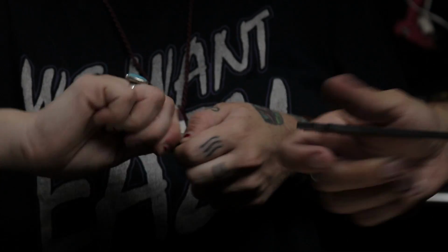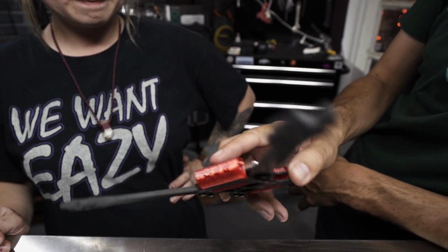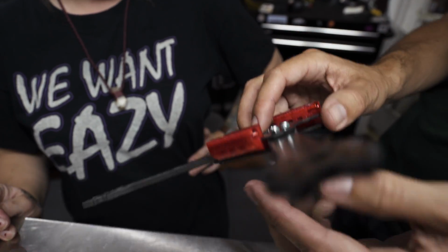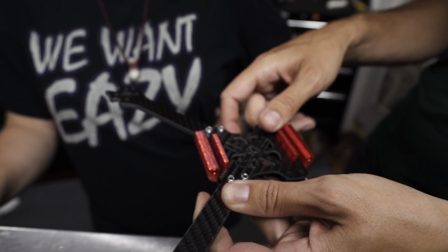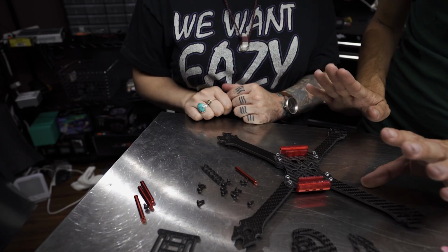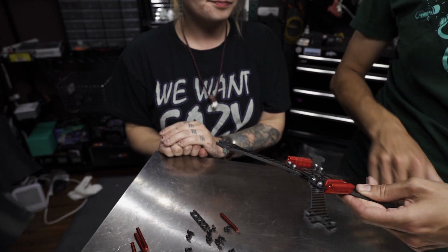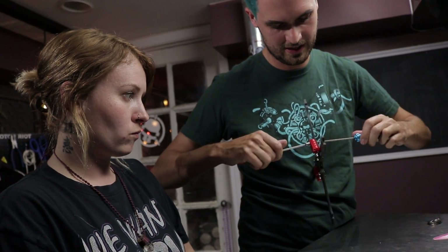Right? So you got the bottom plate and your 3D printed pieces in there with standoffs in there. Okay, and then your middle plate, screw goes up through, you fit the nut, and I like how the arms kind of all interlock in the middle, so then once we insert this 4th one, it should be pretty rigid. Alright, so everything is kind of loosely in there. I think we can snug it up a bit, but you don't want to tighten it too much because you might still need a little bit of wiggle room, but let's just get it so they're not wobbly.